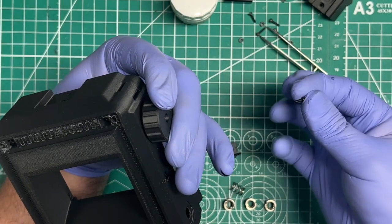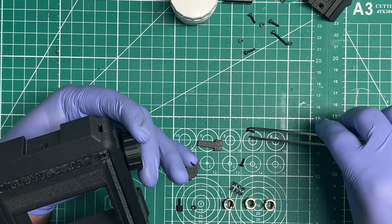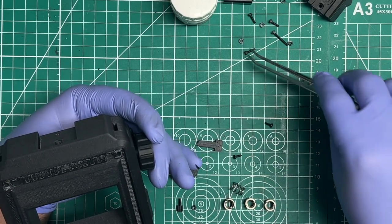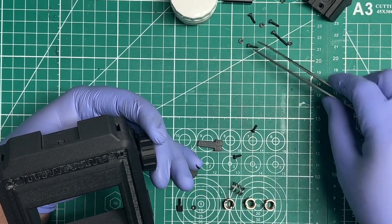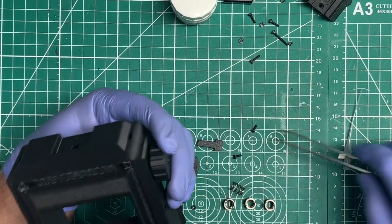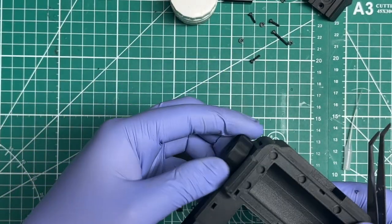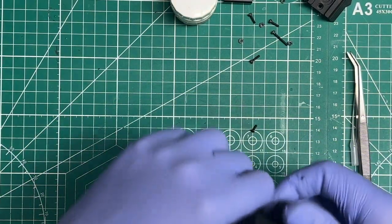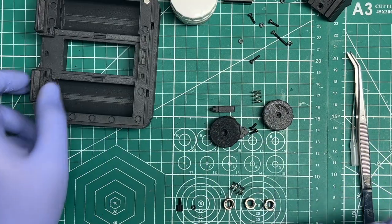And then you'll put in one of these little screws. Now these are M2x6 button screws because that's all I had anymore. But if you got the DIY kits, you got another 2 of the M2x8 screws that you've seen up here previously. So yeah, you'd screw that little bad boy in there and then let it go, and it should be good to go, and you should have a knob with a spring pull action. So, and then you rinse and repeat for the bottom knob.